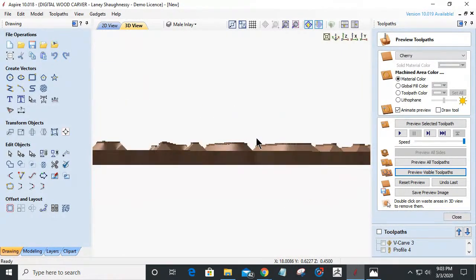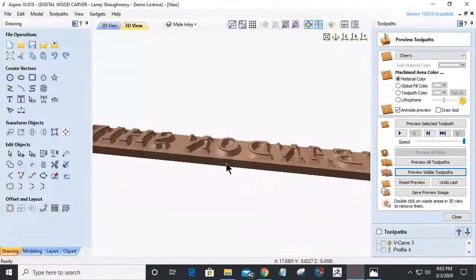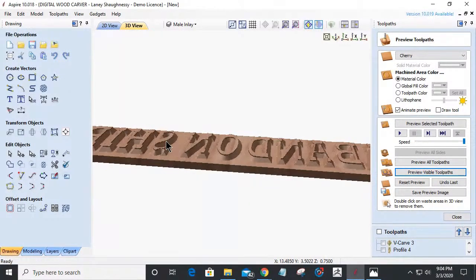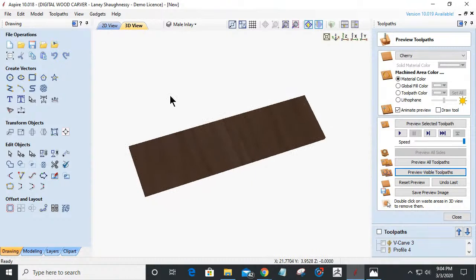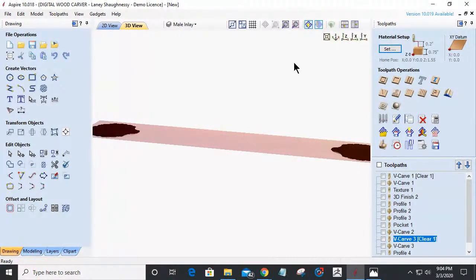Okay. So I'm going to have this piece here, and it's going to fit into that female pocket. When it does, there's going to be a little bit of a gap. I'm going to clamp the whole quarter board with that in there back on my CNC table, flip it over, and mill the top surface of this all the way down to my inlay. Hopefully you guys got that. One of these days we'll do a project on a V-carve inlay.